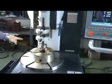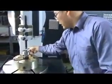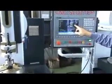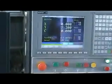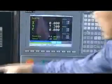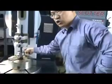So now it's touch. Now it's touching this point. This point is where the cutter first touches the workpiece at the keyway. The value is 7.2. This means that this point is the first floating point. X is 0, Y is 7.2. So you get the first floating point.